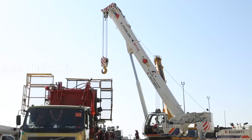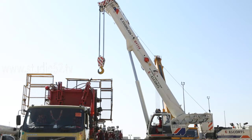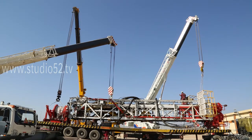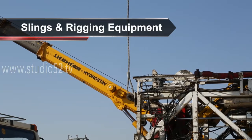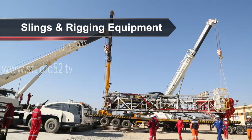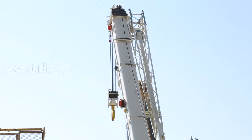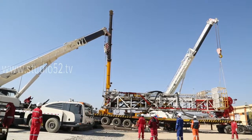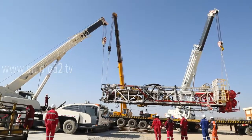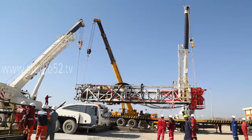Crane lifts can be large and complex, and will include activities that all bear risk. The connection of slings and rigging equipment used to attach to the mast can cause structural damage if the selection is incorrect. Also watch for the movement of personnel and other vehicles. During the loading and offloading of masts, consider wide load distribution and the length of load overhangs.